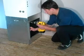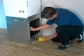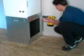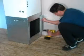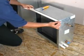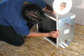To connect the cooling modules to the high-velocity system, use the supplied L-brackets. The L-brackets are first installed on the fan coil or return air base, depending on the type of configuration selected. Before attaching the cooling module, the supplied isolation tape needs to be applied to the frame edges.